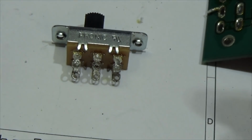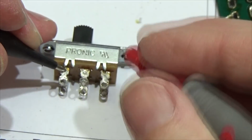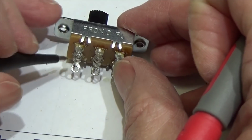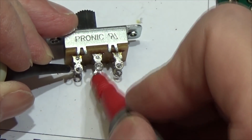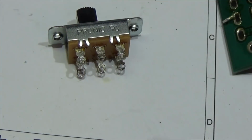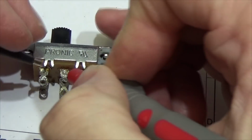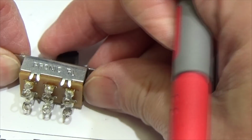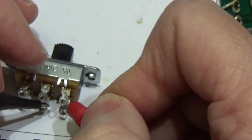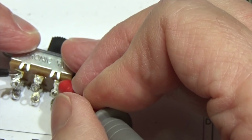Okay, so the switch is out, and now see its behavior. So that is right. The switch is here, so these both contacts are connected, and the same should be here, and they are not in any way connected to each other. So if you like, these are 2 individual switches, this part and this part, and that is what we see. And now when I flip it over, now the upper side should be in contact, which is exactly what it is, and here we should not see any contact.